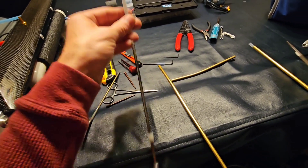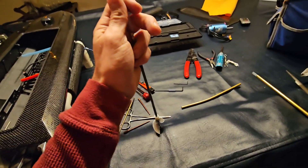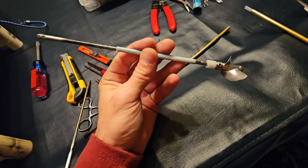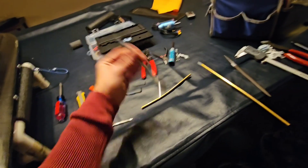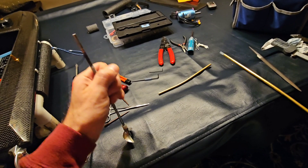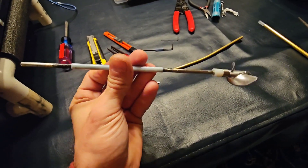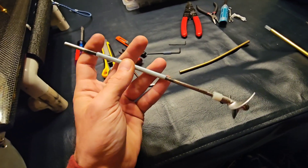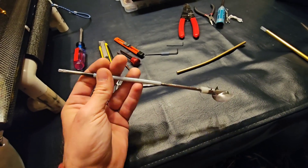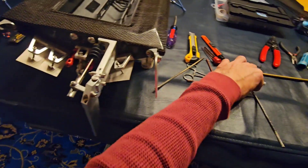It does have a little resistance up there at the motor coupler. But I was extremely surprised by this — there is no room in this at all. I just can't get that liner to move. That is tight, tight, tight. So I feel like when I swapped out the shaft, thinking I was doing a good thing because the cable was better, it was actually a hindrance. This is the upgraded version, and it has the bearing in it, not the bushing. You really have to force it. Somewhere in there the bearing's internal diameter is supposed to be 4.76mm to where it rides on the 4.76mm shaft. When I got this, the shaft was actually 4.82mm and I had to sand it down to get it to push in. It was a little out of spec.